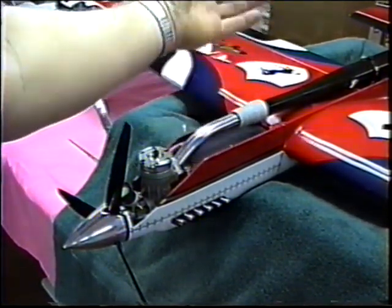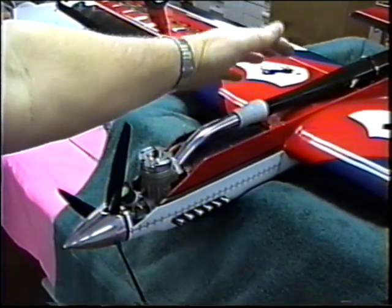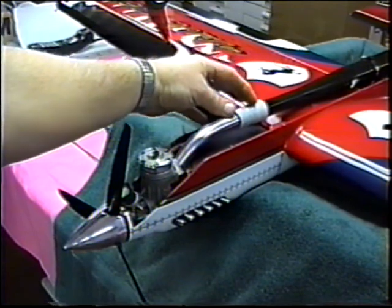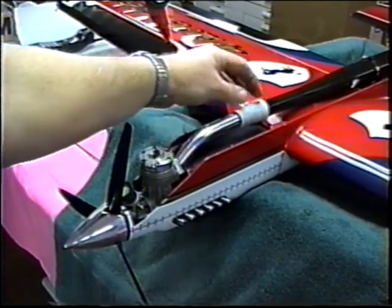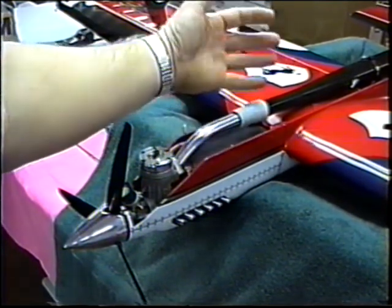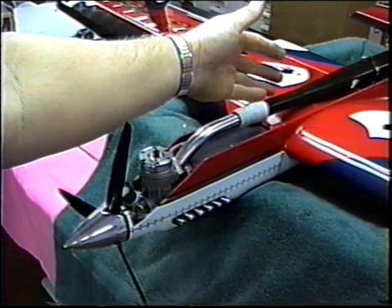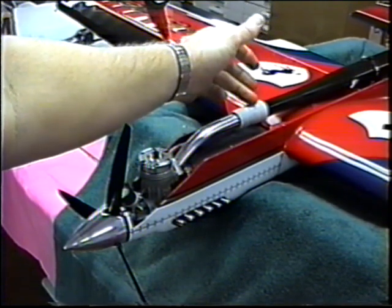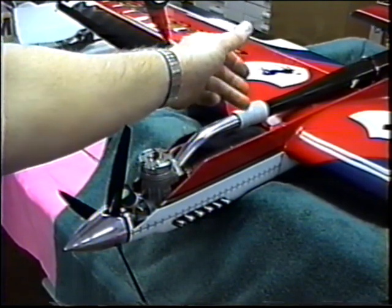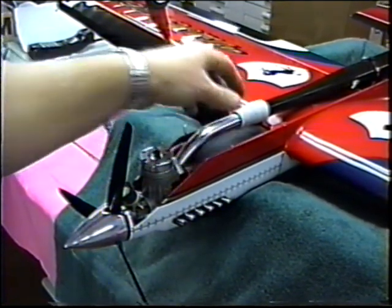And we're going to, obviously, in the course of tuning the plane and flight trimming it, make another pipe with the trombone front, an oversized front, so we can move the front back and forth and do some fine tuning. Then when we find what we hope is going to be the ideal length, I'll come home and make 3 pipes, one that size, one 1/4 of an inch bigger and 1/4 of an inch smaller. So I don't have any gap at all up here. No gap at all is what I'm looking for.